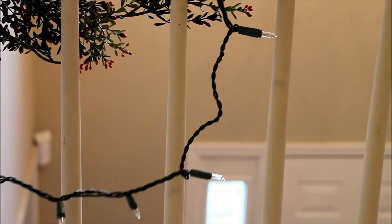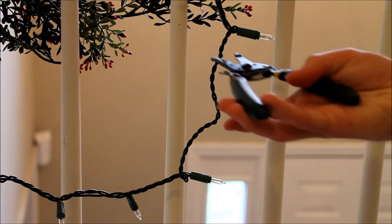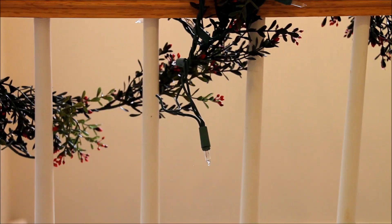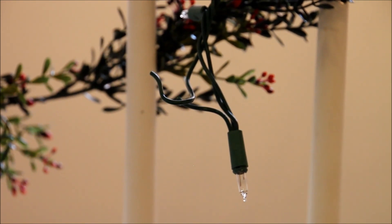The first thing we're going to do is just cut it off. Once you've cut off the wires, you're pretty much done — there's no more wiring that you really have to do at this point, other than capping off the two wires that you just cut. After you separate the wires out, I'm going to go ahead and plug it in and make sure it's working, and then we'll put the wire nuts on.